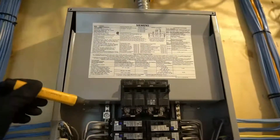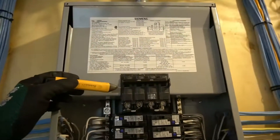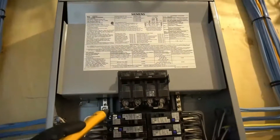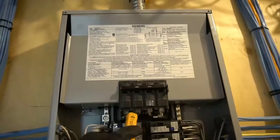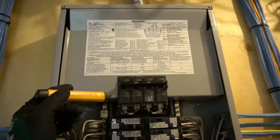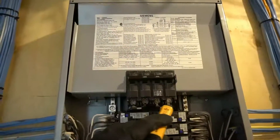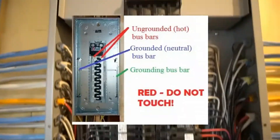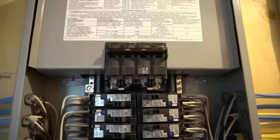It is very important you do not touch any bare metal or copper showing above the main breaker handle, because it is still alive — there is still electricity running through it. As a safe practice, do not touch these bare metal parts. If the main breaker fails and you touch it, you could die. There still could be electricity running through these even though the main breaker is off. Another thing you should not touch is the main bus bar, which could potentially have electricity running through it even though your main breaker is off.